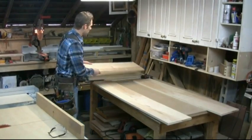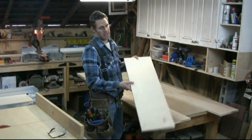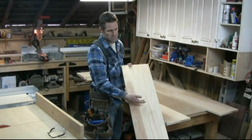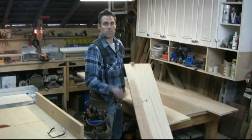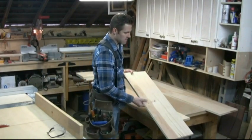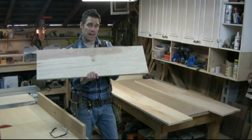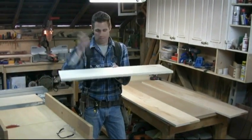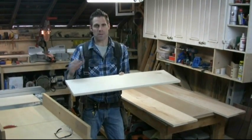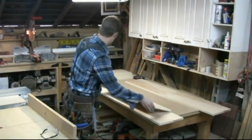I'm going to drill some pocket holes in these. When you have plywood, you're going to have two different sides — the nice side, which is the A side, and then for this type of plywood you're going to have knots and stuff like that. This I'm going to make the inside. If you were staining this, you'd want to get a higher grade plywood. I can get away with it because I'm painting. But when you're cutting your pocket holes, take into consideration — if this is one of your shelves, you might not want that on the top. Be very clear that this is the top. Maybe take your pencil out and mark it with a T — 'this is my top' or 'this is my side.' Be a little more careful and picky when you're building it because it really does show in the end. Pocket hole time.